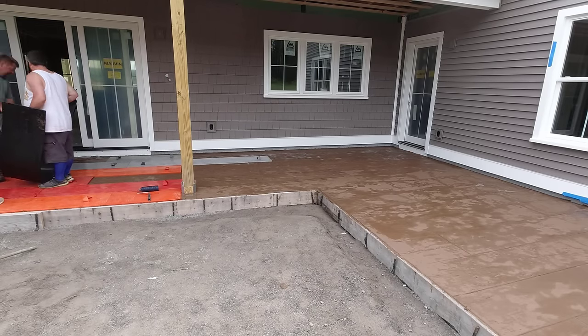This is a few days after the pour. Those lighter areas in texture you could see on the pour — you can't even notice them now. It all has texture and looks like really good wood grain. We're spraying our sealer on. The sealer I use — I cover what it is, why we use it, and where we get it in the Concrete Underground. It's the best sealer I've found for stamped concrete. I like doing two to three really light coats minimum. We did charcoal as the texture enhancer for the secondary color — main color brown, charcoal for secondary — and that gives it the wood look. Subscribe if you haven't yet, let me know what you think in the comments!